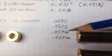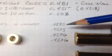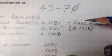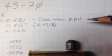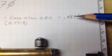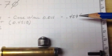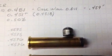I recorded those maximum dimensions here. As you can see, we're running about .4575. Using the case bore diameter, which happens to be .481, minus the wall thickness of the case, which is 11 thou, or 22 thou for two walls, I come up with a case bore bullet diameter of .459. That's the maximum that will allow bullet release without an interference fit.